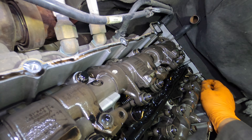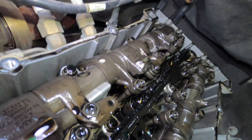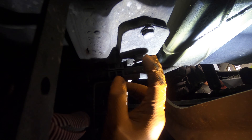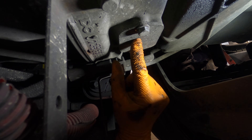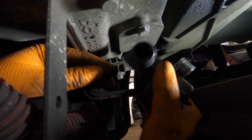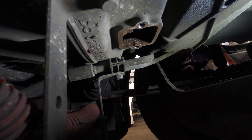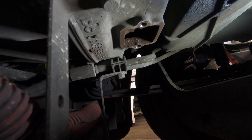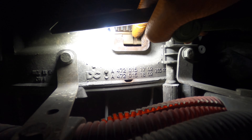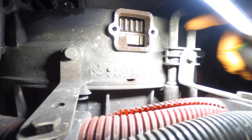On these DD15s, timing's on the back side, so you've got your gears on the back. There's a tool that gets placed right here — you align it, bolt it down, align the mark with the tool to the gear, lock the crank on the bottom. We're on the lower side of the engine. DD15, DD13 — same setup. We're removing this cover right here on the flywheel housing to install our tool to turn over the engine. Put a half-inch ratchet on this end and we'll be able to rotate the engine. We're looking for a divot on this marking right here; align it with the corner of this pointer and that tells us we're at TDC — top dead center.